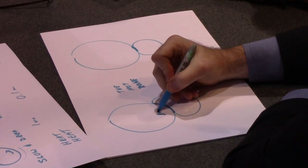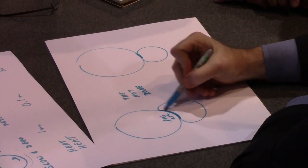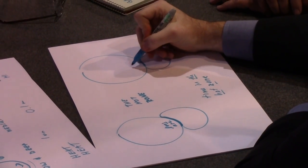Finally, there's reason number three. How much time are we going to spend in the grinding zone? Time in the hot zone. Now, this is the hot zone. This is where all the action is going on. Things are hot here. Time in the hot zone. Now here our arc length is long. Long arc, slow, right? Because we have a big depth of cut. Here our arc length is short.